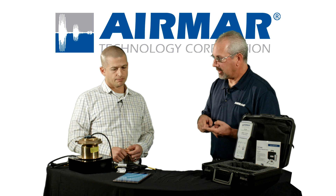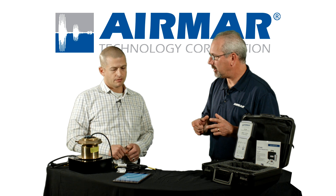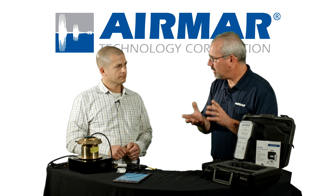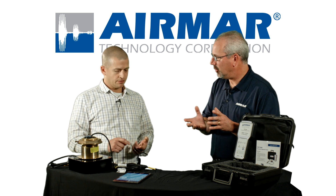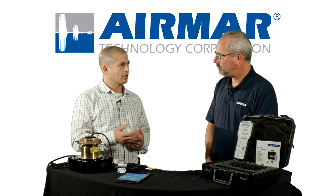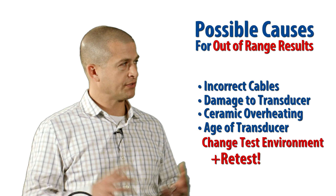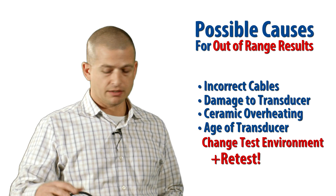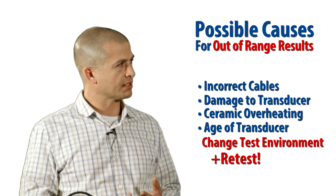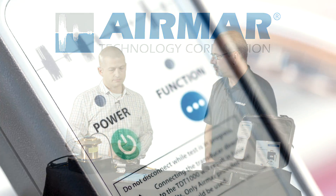So if I get a fail, I may want to try that test again and alter the environment a little bit. In the test environment, sometimes when you're testing in a marina with a concrete bottom, let's try that test out in some deeper water, away from more of the electrical environment you might see in a typical marina. If you're testing on the test block, do you have enough water wetting that face? Have you tried testing two or three times? Are you getting consistent results? It's good information to share with a technician when you get on the phone and try to troubleshoot with AirMar customer service.